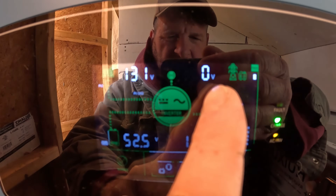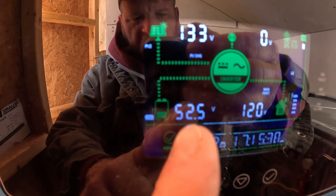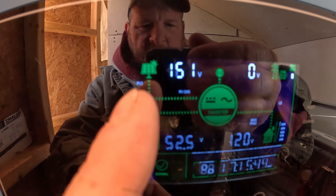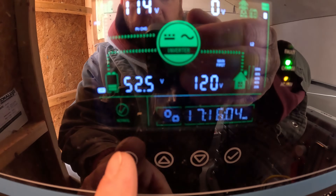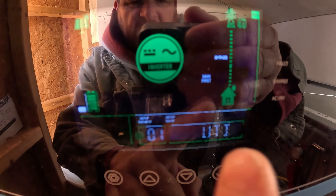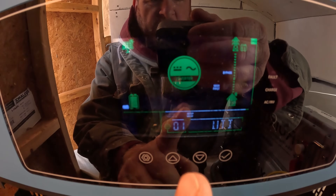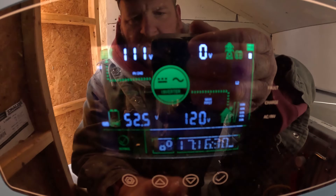Here is our grid power, which we don't have set up — zero volts. 120 volts going to the cabin. Battery status: 52.5 volts, and that's with a charge going into it. We have two solar arrays and this bounces back and forth from PV1 to PV2, showing 150 volts on both of them pretty much. The settings are pretty easy once you read them a couple times. You can go settings 1 through 38. You can change it to grid-tied or off-grid. This screen is showing how many amps I'm bringing in from the solar arrays — about 3 amps from both.